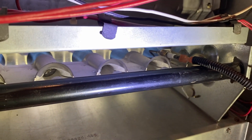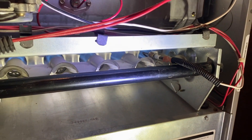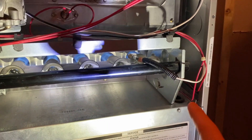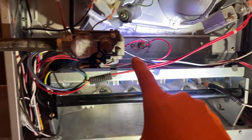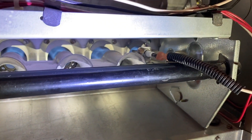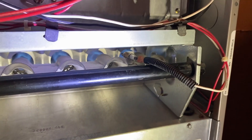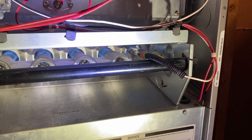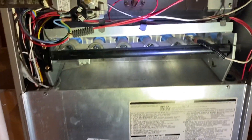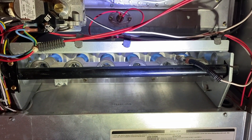The position of that sensor lead is inside the flame right now, and it is creating an electrical charge in microamperage, sending that microamperage readout to the onboard computer. In the event that it is not providing that amperage, or it's outside of the microamperage limits, your control board will detect that and shut the entire system down.